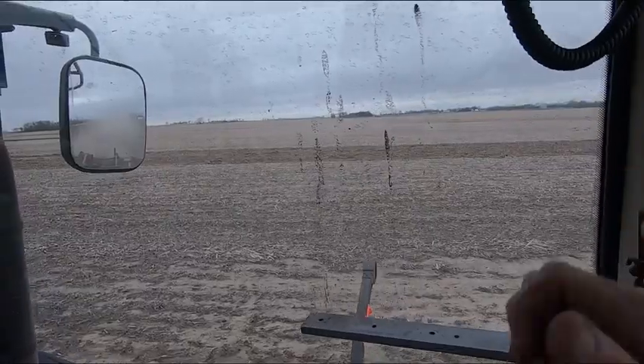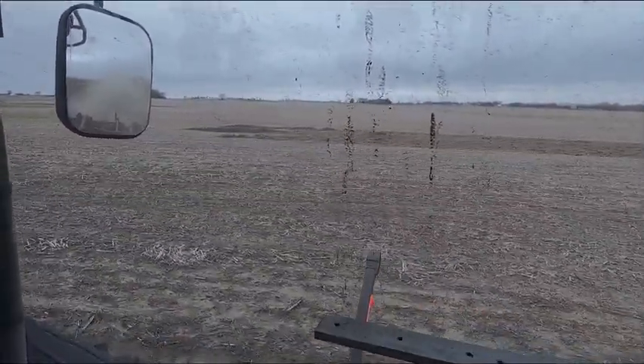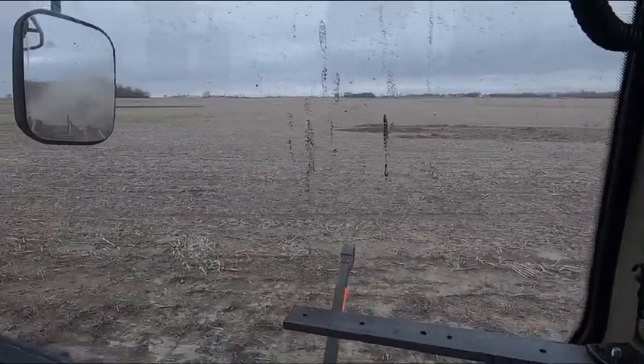So it's a little bit overkill, but this is what we had available. You can kind of see over there all the piles I had left — that's where I was having trouble with those coil tines. I got them angled back a little more and it's doing a lot nicer job now.